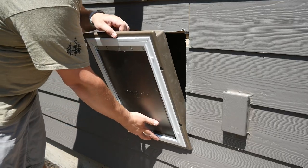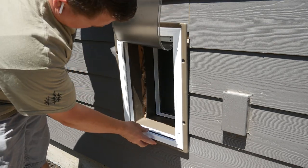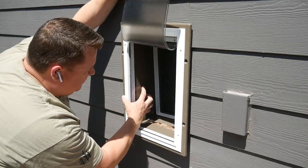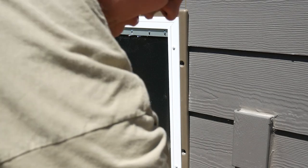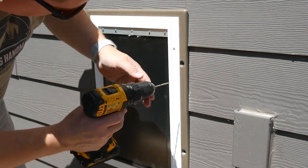We're just gonna match up our exterior with our interior. You can look right through the flap here to make sure that your sides come together properly. It's very often a good idea to pre-drill holes, especially in this exterior board.